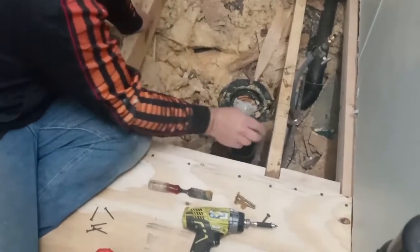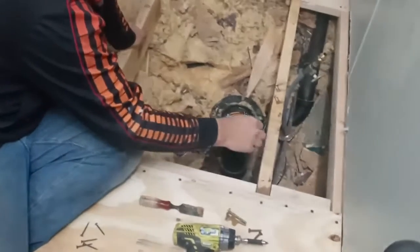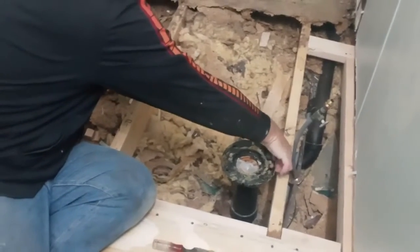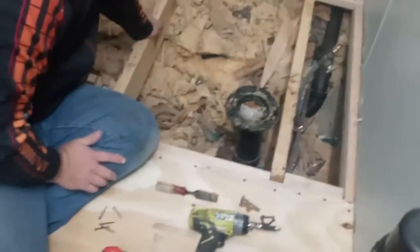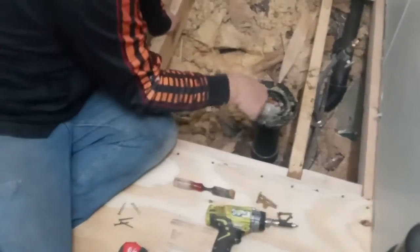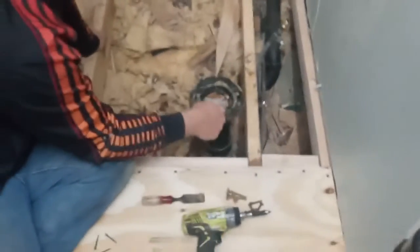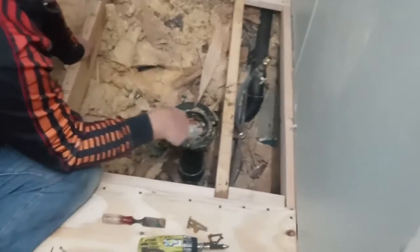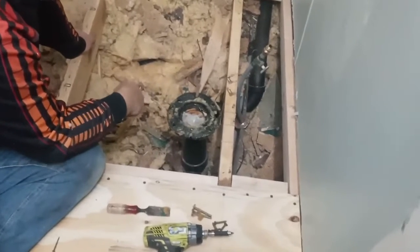And quite often you'll have a little bit of particle board that was cut. This Phillips head generally, and I believe there's usually 4. You can put more. You tend to want to be careful. You can pre-drill holes. Say if your flange got broken, you want to fasten it another place. You can pre-drill holes and then do it, or you can run your screw in backwards, like a 1.5 inch screw like this. Run it backwards and sort of make its own drill bit.